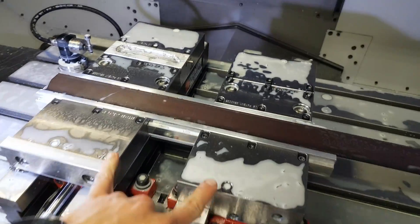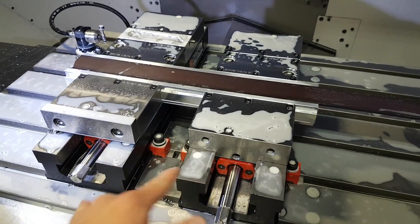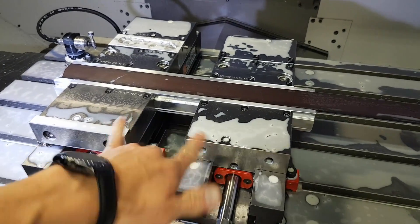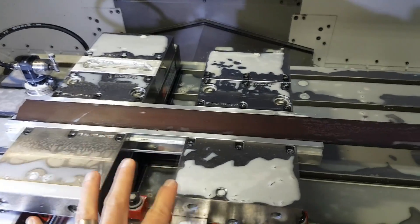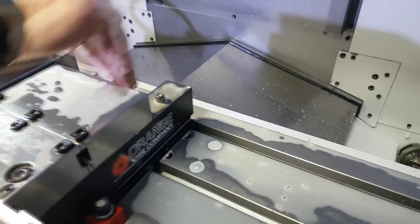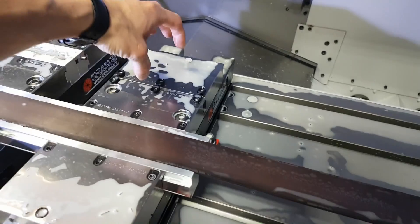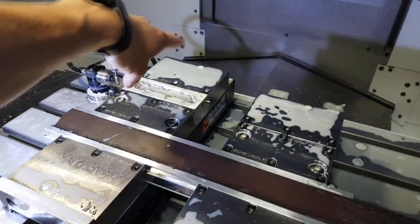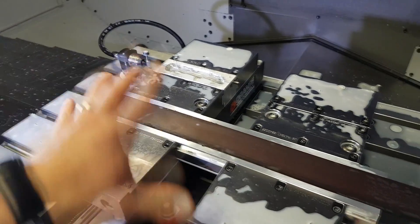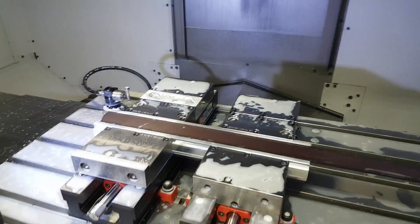Interesting thing when you have two single-station vices: they become very difficult to tighten because you have to kind of walk them in together. These are two double-station vices — you can see the whole back section slides by itself. If I loosen just this one, it's no big deal because the back section just starts moving back. When I move this one, either the back section or the front section will move, and it just works very, very nicely.